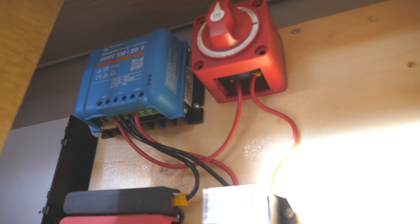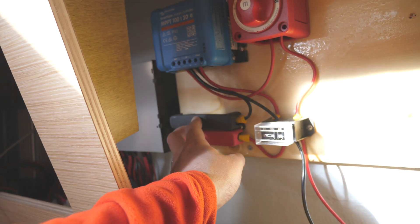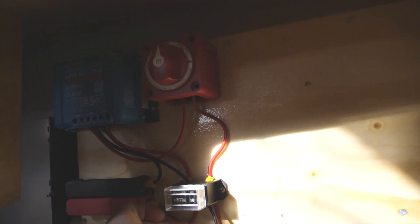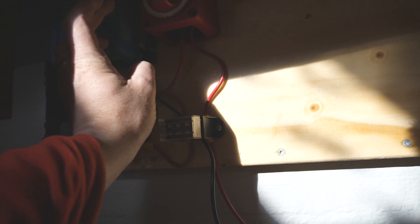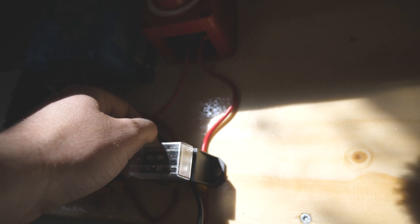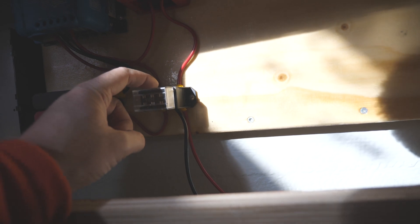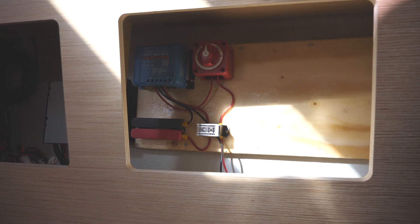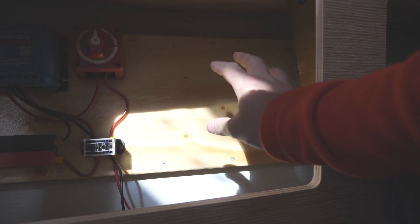I don't think the shunt and charge controller entirely need to pair. The solar panels come in here going into the bus bars, then through a fuse into the charge controller, out through a switch, then through another fuse and down to the batteries via these two cables. I've made the board a bit longer for future expansion — I might want to put a Raspberry Pi up there and other gadgets. I've just attached this with velcro and it seems really solid at the moment.